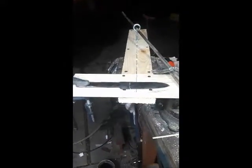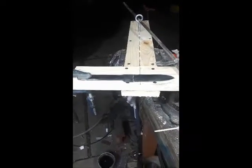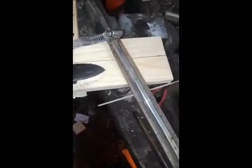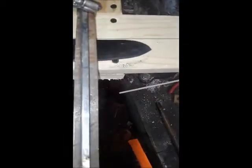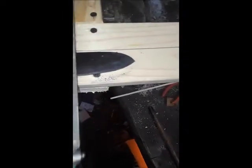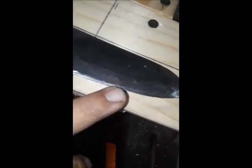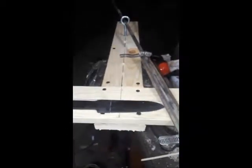I've got my knife set on my filing jig. Normally, after finishing hardening and tempering, people go back, clean the knife, and then start doing the bevels. Me, I don't — the reason why is it's dark, so I don't have to mark it again with marker or paint, and I can see my grinds a lot more clearly when I start. I've already set the line where I want, and you can see where the metal is starting to show through so I can judge and clearly see how far up my grinds are going.